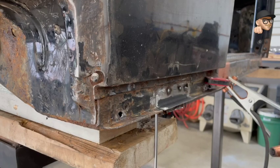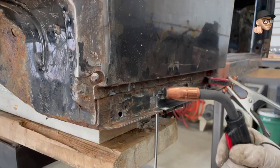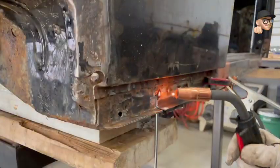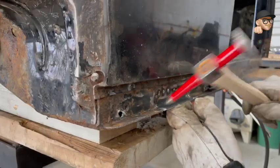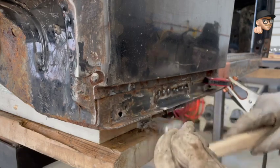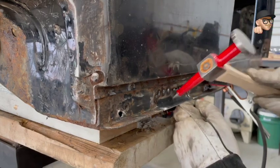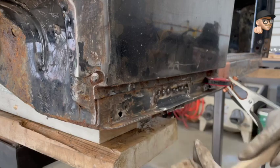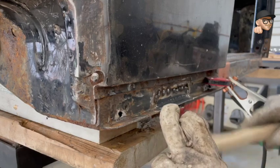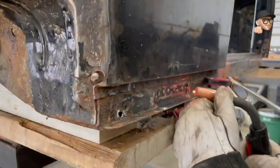This is a little Fitzy fabrication trick I saw him do: you just take a screwdriver and pull the back out. The metal's not perfectly smooth and flat in there so just use a screwdriver to pop it out and then throw a tack on it — it works really well. Once you've been welding for a while and you get a whole bunch of spots in there — again this isn't a really critical area — it does tend to warp and shrink a little bit. So what I'm doing here is just hammer forming the bottom to contour that bend where it meets the bottom little rail, then hammering it smooth and flat so it meets up with the edge.